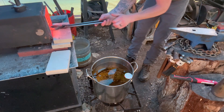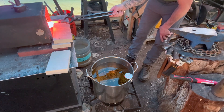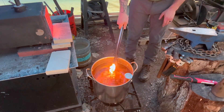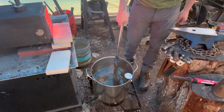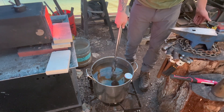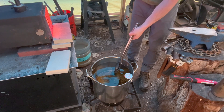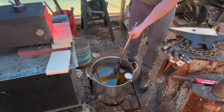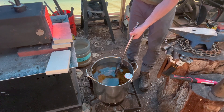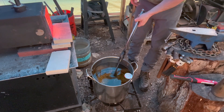I'm going to pick it up, check for a shadow — looking really good — give it a couple runs under the jet. Now that it's in the oil, I'm slowly agitating it back and forth with the cutting edge to the spine, but not going against the edge because that's going to have weight and resistance and cause it to warp. If you go with the cutting edge it'll keep it from warping. You want to hold this in the oil until you stop seeing bubbles, because that means it's cooled down evenly throughout and you have a lot less risk of flashback. Be careful not to bump it off the bottom of the tank, because that can contribute to warping.